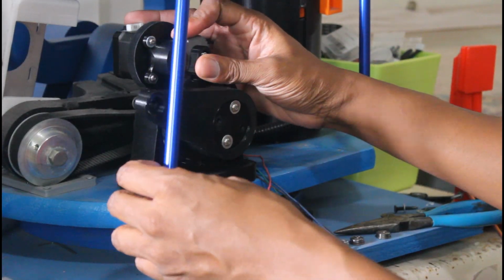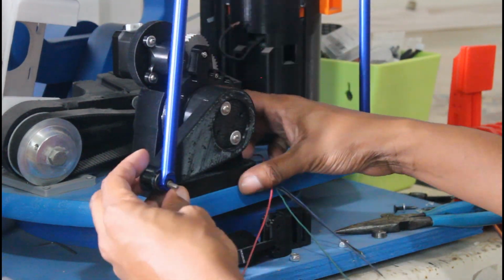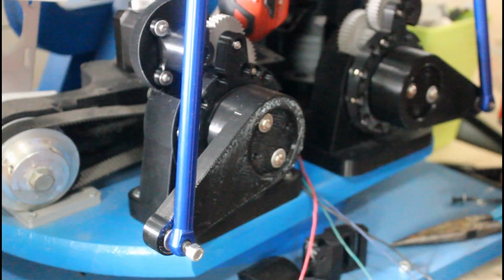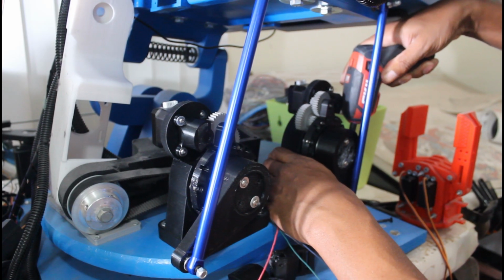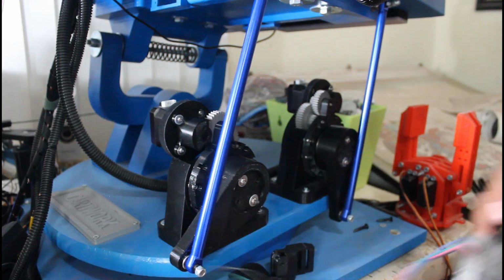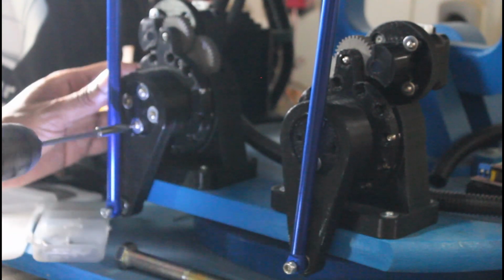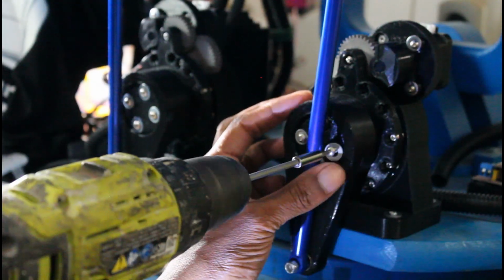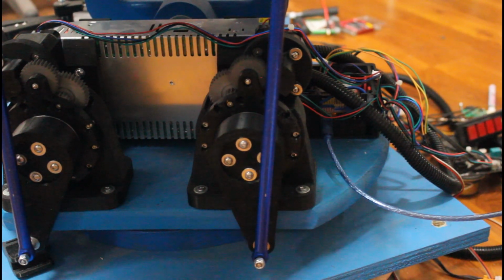After removing the old servo motor holder, I screwed down both actuators on the right and on the left into the wooden panel disc on the base of my robot. Each actuator is separated by 2.5 inches in between them, lining up directly below where the holes on the rods attached to the robot head. We'll also be securing our metal rods to our levers with our M4 by 35mm bolts. Once that was done, I screwed in more screws to secure both levers so I can test the actuators. After they're firmly secured, I tested the movement of the motors as well as the lifting capabilities.